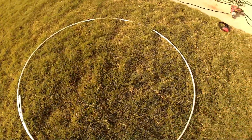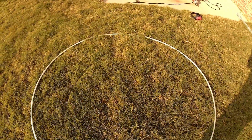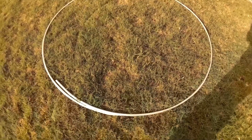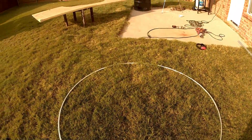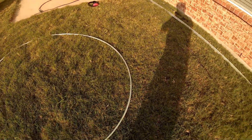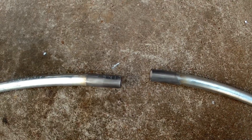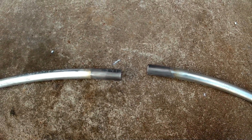So what I'm going to do is cut them down and weld it at the very top and also down at the bottom of the base of the paramotor. The bends came out nice and smooth and it only took me about 10 minutes. EMT conduit is treated steel so that it doesn't rust. Do not ever weld on EMT conduit without removing the coating — it releases toxic fumes and it might kill you or give you brain damage.